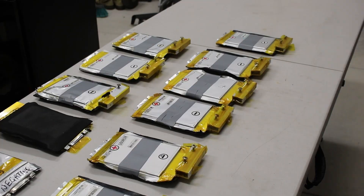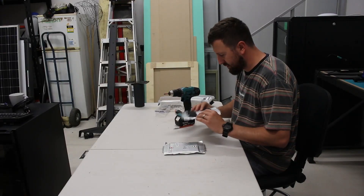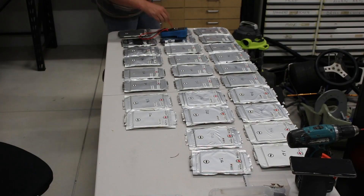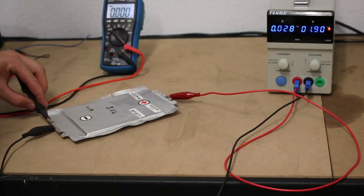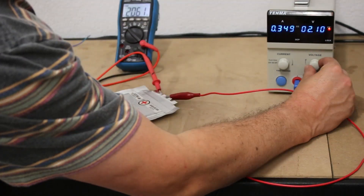I processed the cells by removing all the Kapton tape and insulation to get them back to a factory state. During visual checks I noticed one or two had bulged slightly. Interestingly, 90% of them were registering above one volt on a multimeter, so I did some careful recharging with an adjustable power supply, gradually increasing the input voltage and monitoring the effects until they could be picked up by my battery charger.